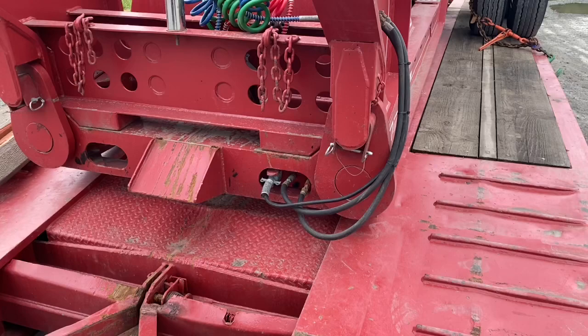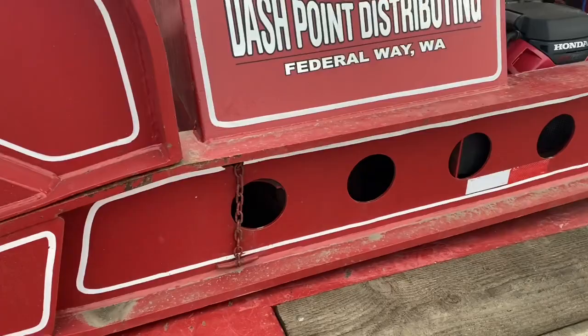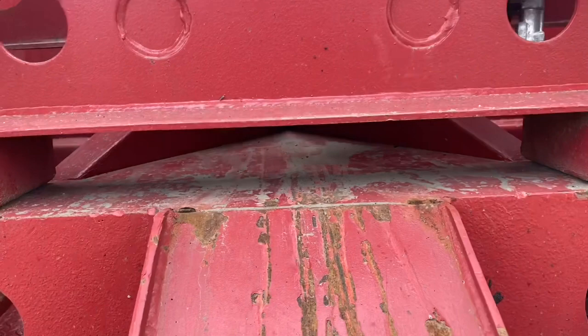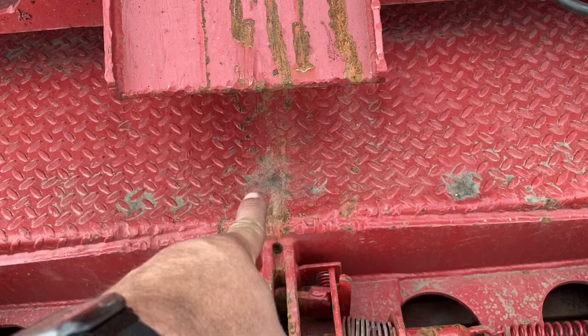There's a dog bone — there's one — gotta remove those, those airlines. Hook back up to it, pull the chain over here that holds the pin and we'll detach this neck. One really important part: this little ramp here is where that pin in the rat tail goes in the mousetrap to hold this neck to the trailer, and it'll come out here.